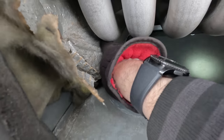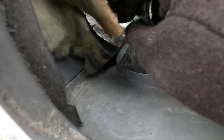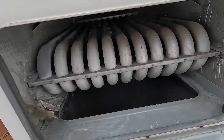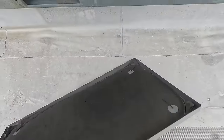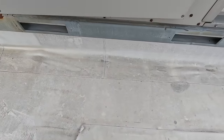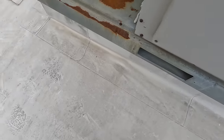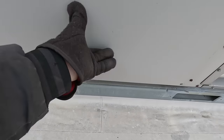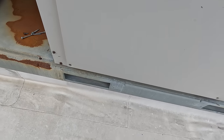Where they've got restriction on the airflow, that's going to allow that pipe to get a lot hotter, which is going to cause it to potentially crack. Let's watch that — make sure that it's not got flame disturbances. For right now, let's get it running. If it doesn't have flame disturbances, we'll be sure to put on there that it's highly recommended that it be thoroughly inspected. Cover your bases — that way you're safe, your company's safe, people are safe, customers are safe.